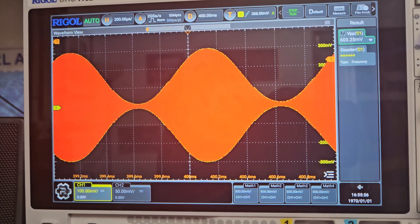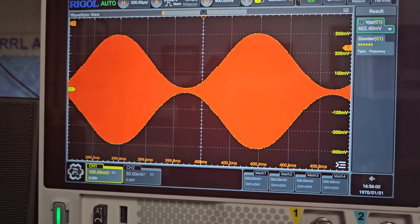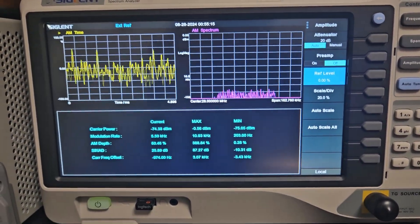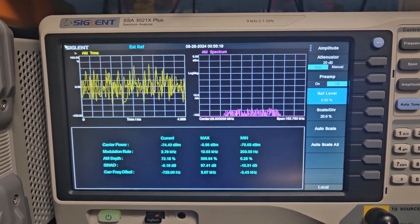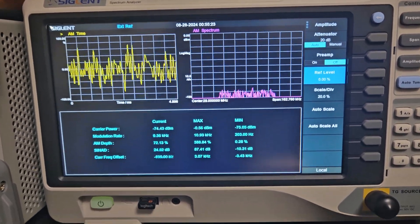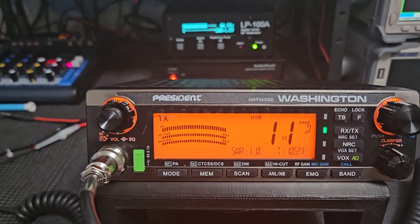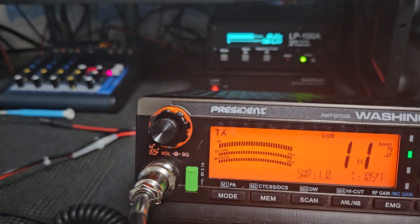Here's the top modulation — it's your 16-watt carrier and it looks really good. It's one of those things where you decide where you want to go with it. I've been getting more into ham radio a lot lately, so now we're going to measure the factory sideband performance — the TOI. It's an important feature to measure.